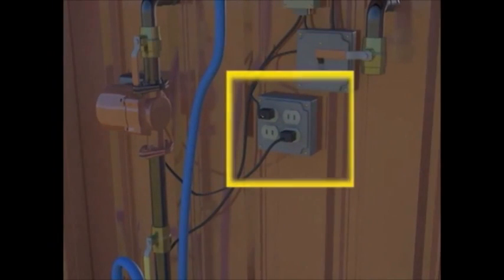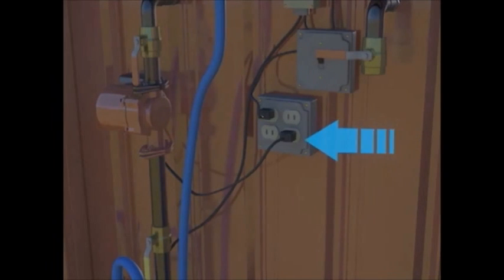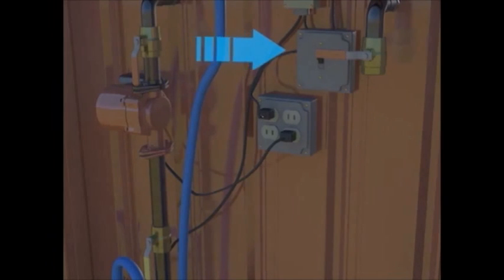You will also see two electrical outlets side-by-side in the center of the furnace. The electrical outlet on the left is power coming into the unit. The outlet on the right is a switched plug for the pumps — it will only be activated when the light switch above the two outlets is turned on. A short cord with a male connector extends from the switch box and is plugged into the outlet on the left after power is run to the furnace.